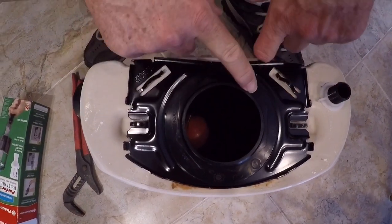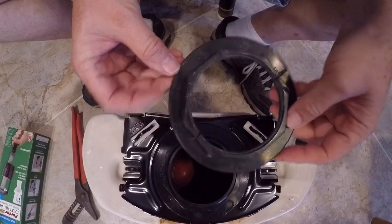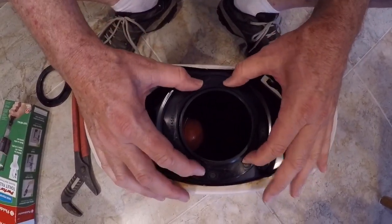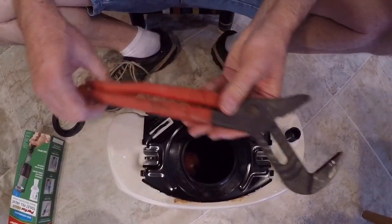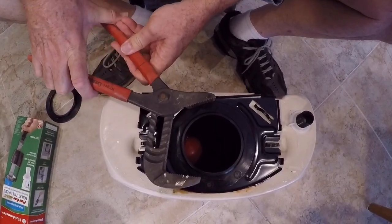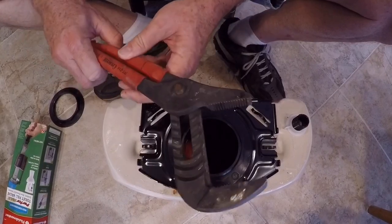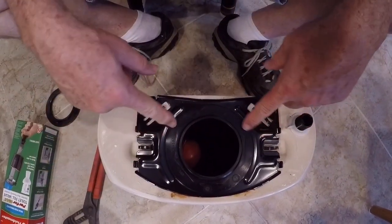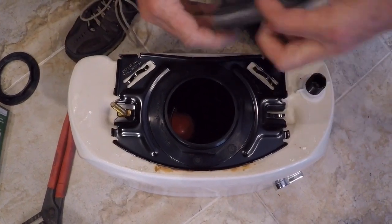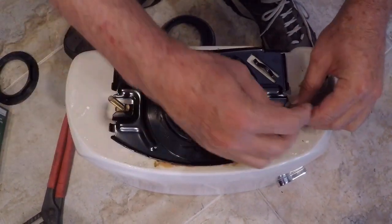Here's the bottom of the tank. You can see the flush valve back in place. This is the retaining nut — the old one is here for comparison — and that threads over the body of the flush valve. It slides down pretty loose, then you take it finger tight. The one special tool most people may not have is a nice big pair of channel locks or plumber's pliers. I used those to get about another full turn on the nut, and with that you can be sure you've got good compression on the rubber gasket inside the tank.